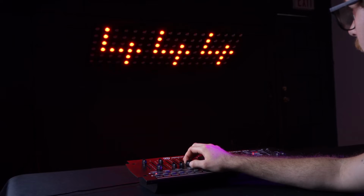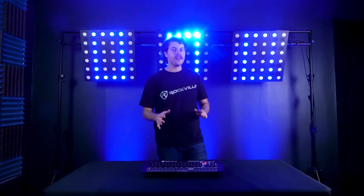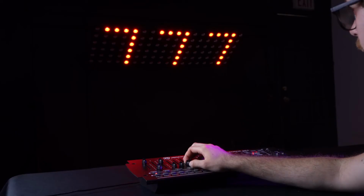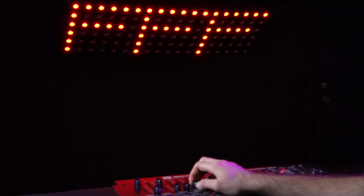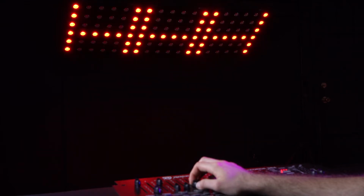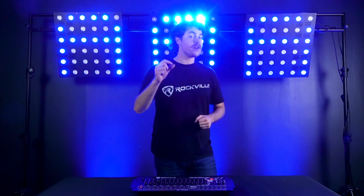Now Fader 6 allows you to project different numbers and letters through the light. Starting with value 10, this will project the number 0, and the higher the value, the greater number will appear. After that, starting at value 20, the lights will start to project the alphabet characters. Again, you can go through the different letters of the alphabet the higher you set the value.